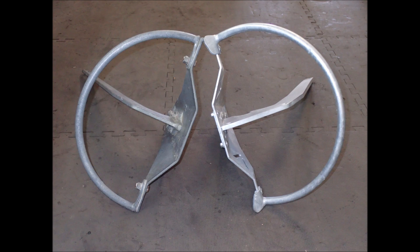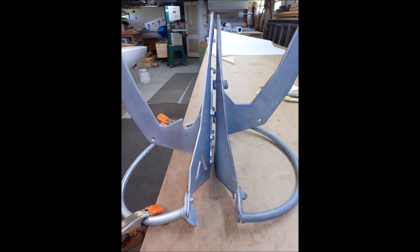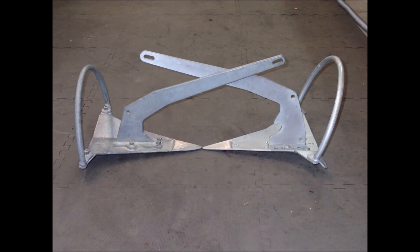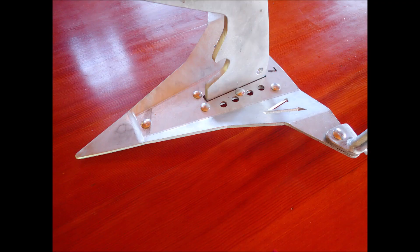Note the Viking has a larger roll bar and that the shank is attached at a point much further back on the fluke. A result of that shank attachment point difference is that the chain attach point is at a completely different spot geometrically with respect to the fluke. Also note that the Mantis's shank flange and bolts are just mounted on the top surface of the fluke, whereas on the Viking, the shank passes through a slot with its shank plate on the underside with round-headed bolts pointing downward. It just makes for a cleaner, less obstructed interface between the shank and the fluke.